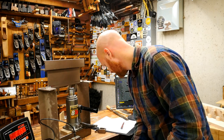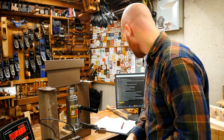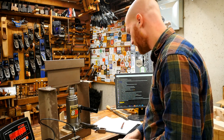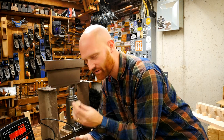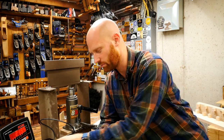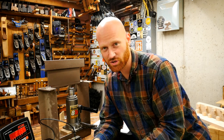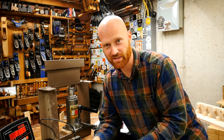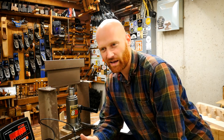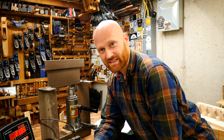I want to get a baseline on all glues first so I know which ones are worth long-term testing — for example, E6000, which many people said is great, has been doing really poorly because it's simply not a wood glue. On the long grain to long grain tests it's usually 60 to 70 percent of the time I can get a clean glue-line break, and the other 30 to 40 percent takes some wood with it. I notate that because it helps me estimate the actual glue strength.